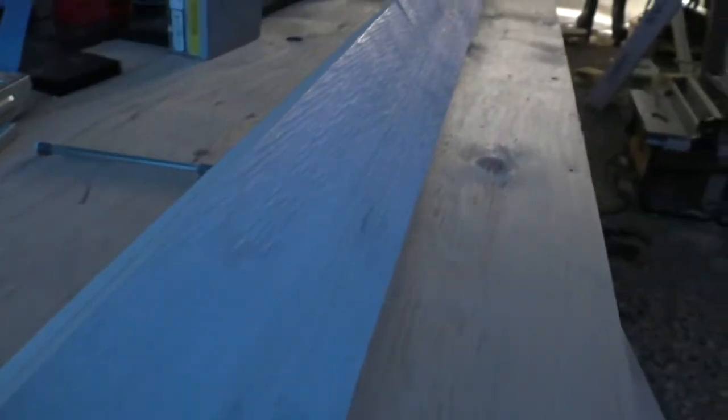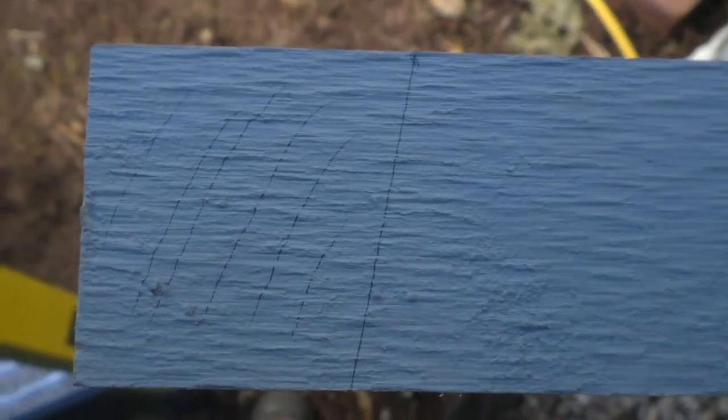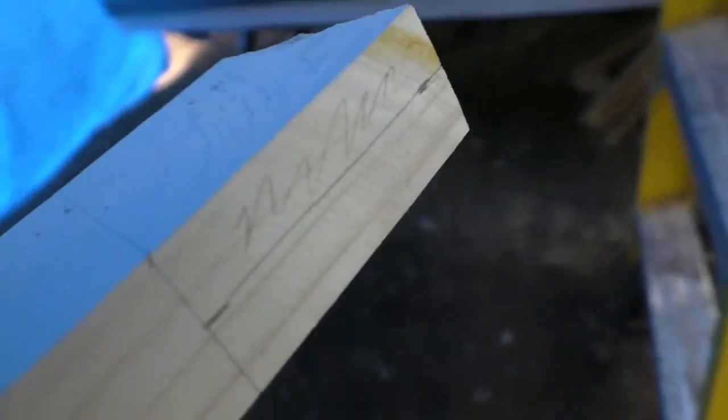I thought it was a good plan, but here's where an earlier oversight finally became a problem to solve. Because I didn't stand off the fascia with a shim or a spacer of some kind on the ends the way I did with the long sides of the house, I needed to notch the corner trim so that it would fit up under the fascia. It actually worked out pretty well. This is a two-person job, by the way. I managed to do it alone, but it was way harder than it needed to be.